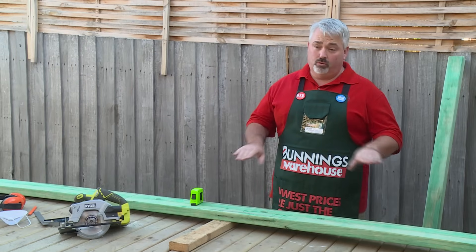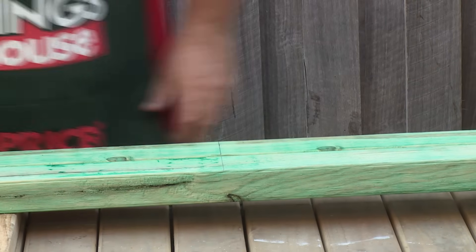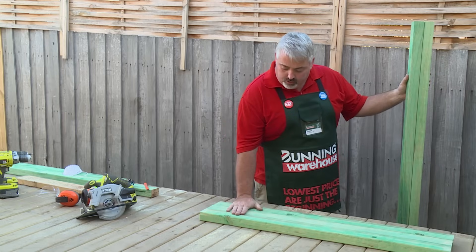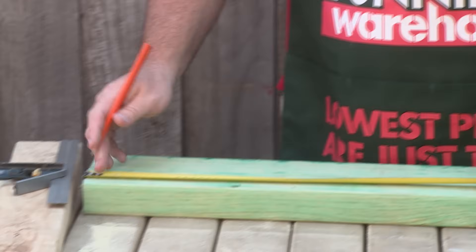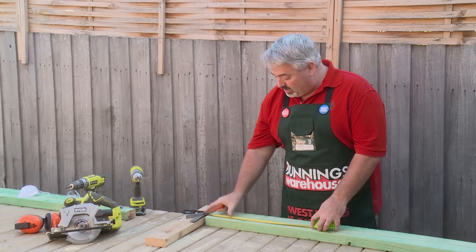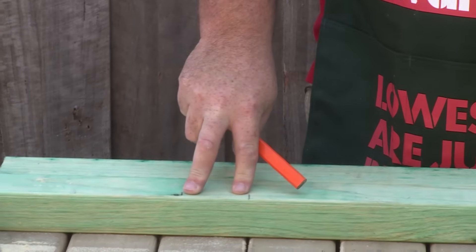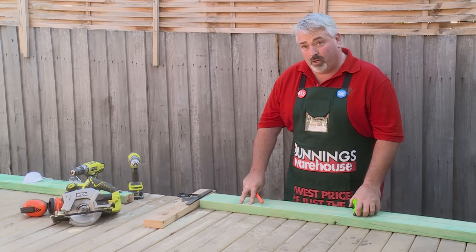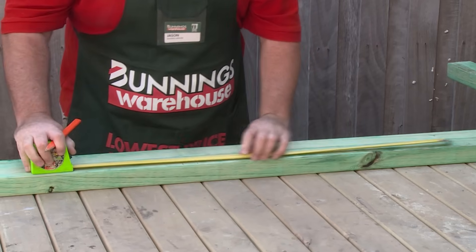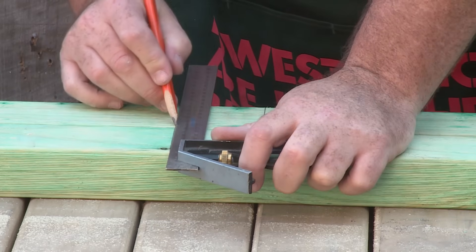I'm now going to cut my three horizontal fence railings. Before I cut these, I need to subtract the combined thickness of the two vertical rails as well. I've now got all my rails cut — three horizontal and two vertical. I'm going to measure up 200mm from the bottom of my gate for a plinth board, and then allow the vertical fence panels to sit down on top. I've measured 70mm for the width of my horizontal rail and I'm now marking where all three horizontal rails will go — evenly spaced, one near the bottom, one near the top, and one centered in the middle. That looks appealing and gives a lot of strength. I'll transfer those marks so both vertical rails have the dimensions on them.